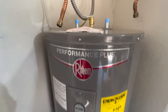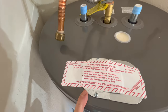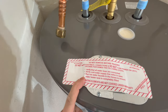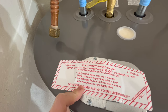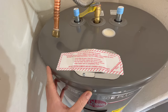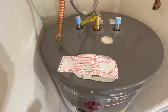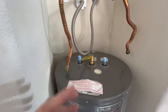New water heater is in place — it's looking pretty sharp. There are some instructions on the top here before you make the electrical connection. The three steps are: verify that all water lines are connected, verify the cold water supply valve is open, and then go inside and run the water once the tank is filled up. Electrical is the last piece — they want you to follow these steps before you remove the tag, so let's go ahead and hook everything up and then finish with electrical.